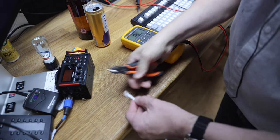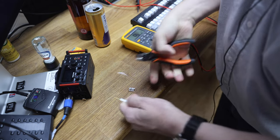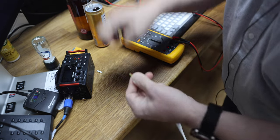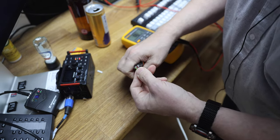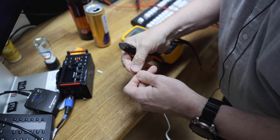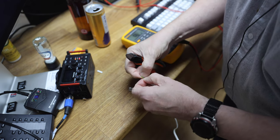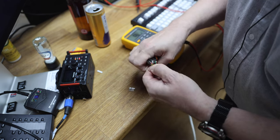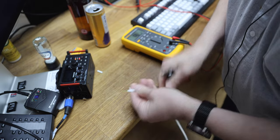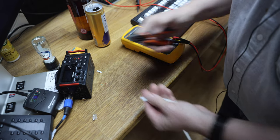I have no idea if this will work, so first I'm going to cut off these connectors so I can do some testing with a multimeter and work out how the thing works. I'm assuming it's passive — not powered. Now this may be a big assumption. If it turns out it isn't passive, I'll probably need to buy the other half of this kit, which is something this plugs into or has some sort of alarm. Fortunately I've got a spare RJ11 if I need it.